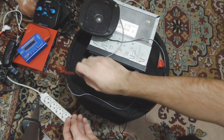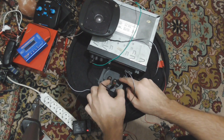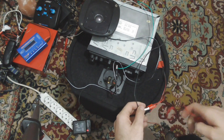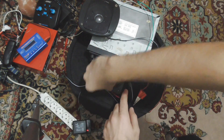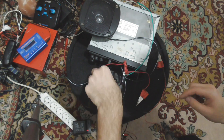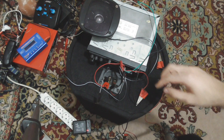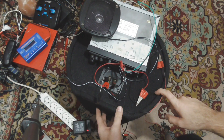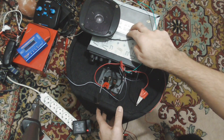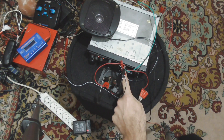The green cable goes to the other speaker — a large speaker with two connectors. Then I connect the speaker common, which is the black wire, to one of the speakers. The same ground connection goes to the other speaker as well. The minus and plus are connected — plus to the red cable of the unit, and the minus goes to ground. Power it on and we have some sound.